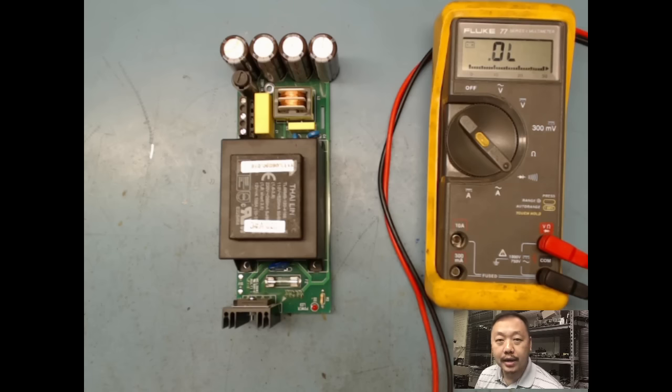And most of the time I would record it. So if I'm working on a more complicated power supply or a printed circuit board with relays and a bunch of LEDs, when I first power up, I'm gonna record it so that I know the sequence. Like, oh, the green LED came on first, and then it started blinking, and then there are two other red LEDs, and one stays on solid and one is blinking on and off. If I have recorded that, then at least I'll know what happens, just in case I blow something up. I want to make sure that I fix everything. Or if I fix something and then the power up sequence is different, then at least I have documentation of what's going on. So you always want to make sure you know all that.